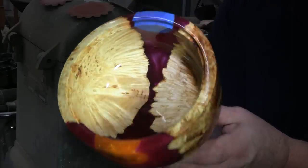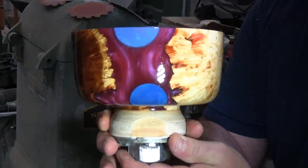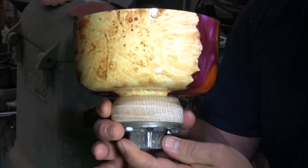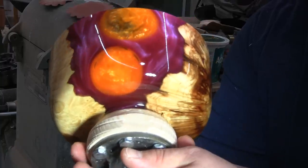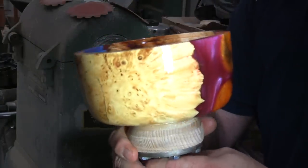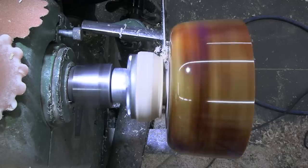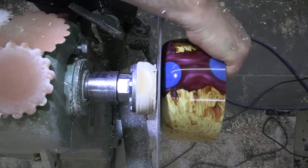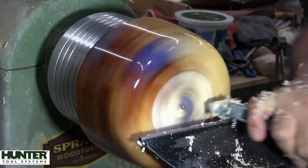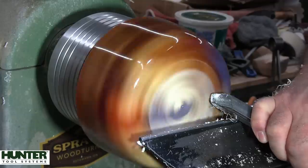It's still beautiful — and yeah, I'm really liking the globe thing. It's too bad that it's going to look like an egg at the top, but regardless it's quite a conversation piece. There were in fact three coats of finish put onto this piece, and here I am parting it off and then using the handsaw to finish it off. Then I've got it mounted on my vacuum chuck so I can easily do the bottom without marking up the bowl at all. The bottom was sanded from 60 to 800 just like the rest of the piece.